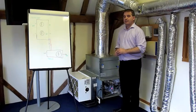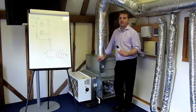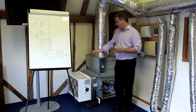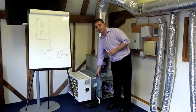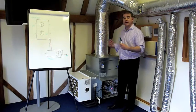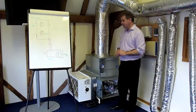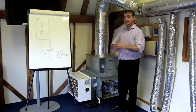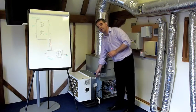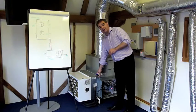Inside now — the heat pump absorbs heat from the atmosphere, puts it into the pipes, which are then pumped inside to this delivery system. This is a draft-free system; yours might look different — it could be a high wall system — but the same principle applies. The heat pump absorbs heat from outside and brings it in through these pipes to our heat exchanger here.